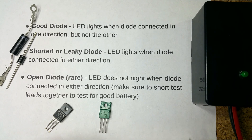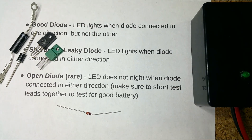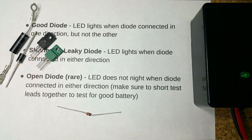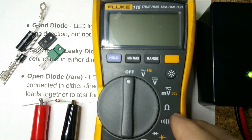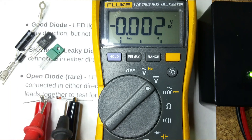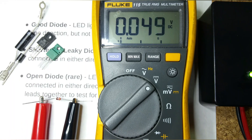That's a general indication that the transistor is good — there's more to transistors than that. To test a zener diode you need an extra step: hook up alligator clips to the tester. If you hook it up the normal way with the banded side to black it will light, but it will also light the other way — that's because there's still a voltage drop, just a higher one. To find the actual zener voltage, hook up a voltmeter and read it directly. In this case we get 5.6 volts — that's a 5.6-volt zener diode. This tester can test zener diodes up to about 15 volts.